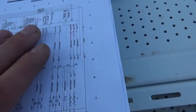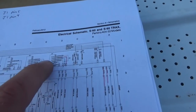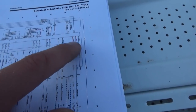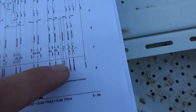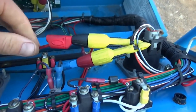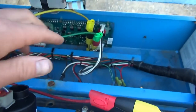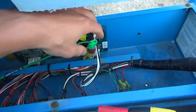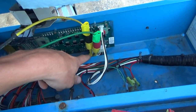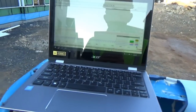What I want to do right now is hook up the Pico scope — four channels. Channel one and channel two on the two inputs X and Y, then channel three and four on the two outputs forward and reverse — to see if we have an input problem. Blue and red are the X and Y coming out of this joystick for the drive, and channel three and four are the two control wires for drive forward and drive reverse going to our drive pump. Let's roll the scope.